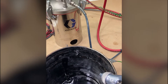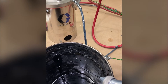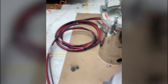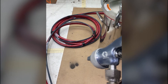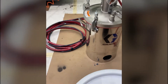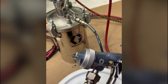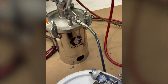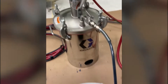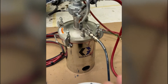I'm going to pull the trigger of this gun into the bucket — you can see our paint stream. What we want is the pressure from the tank to give us about a 10-inch stream of paint coming out of the gun. We're also going to take a beaker and dispense into it for one minute to measure our actual flow rate. You want that tank pressure to be between 10 and 20 to 30 PSI, with paint velocity of approximately 10 inches. Play around with the pressure and tip size to deliver both of those.